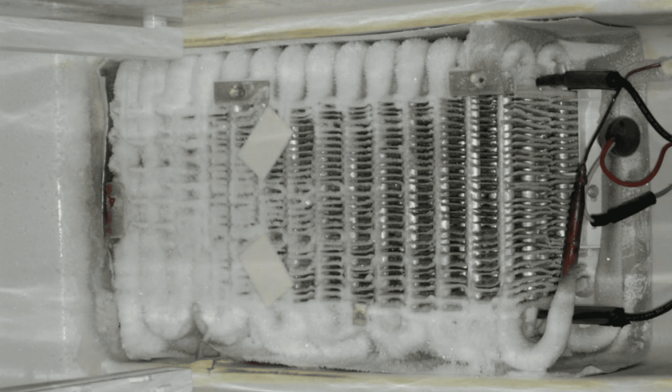Another unusual possibility could be something like a collapsed duct line — a main trunk, especially on the return side — though I don't find that too often. At this point, if you haven't found any airflow problems at all, you do want to wait until your evaporator coil completely defrosts. You don't want a sheet of ice on there because that sheet of ice itself is an airflow problem — air is not going to flow through it — so you have to wait for everything to defrost.